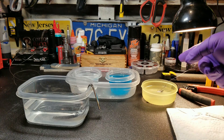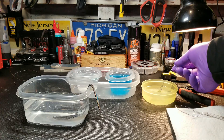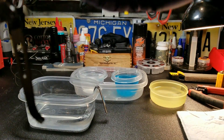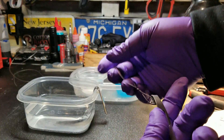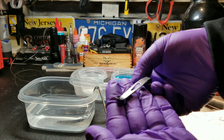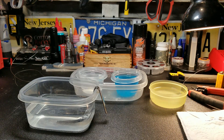You want to go straight from the distilled water bath into your anodizing bath. You don't want to let it come out and get water spots dried on it — but just to show you, it's completely bare now. All the anodizing is off and it even took the polished finish down just a little bit, which is what we want. We don't want a super polished finish because that'll end up making the anodizing a slightly different color, and that's not quite what we're looking for.